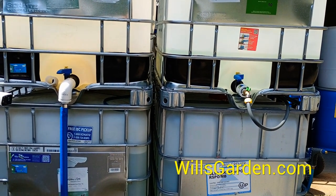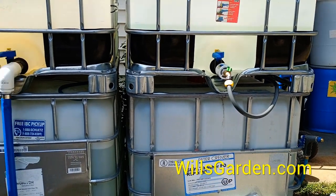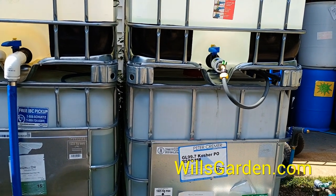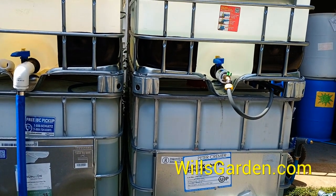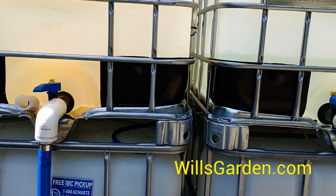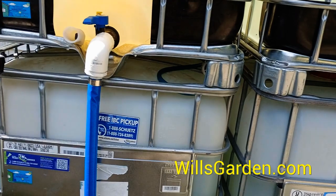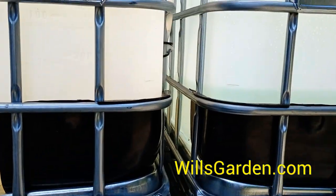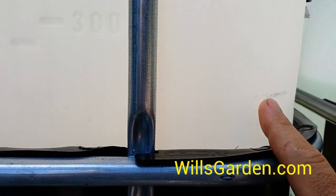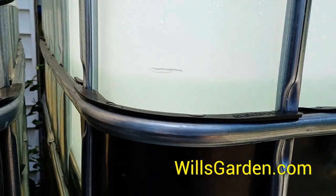I've stacked water on top — this is our high flow kit and this is our regular flow kit. Under normal circumstances you leave all your valves open and the drain comes down leading to the bottom tank. Sometimes if you're in an area that gets downpours and you're going through the water really fast, you'll want the high flow kit. As you can tell it's really moving down — this line right here represents where it was, and that's how fast the standard flow is going.